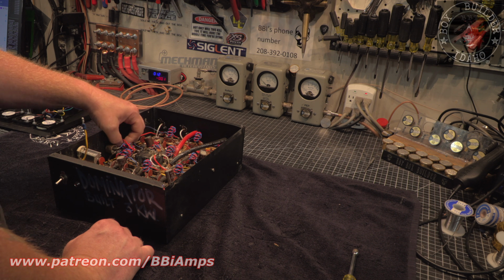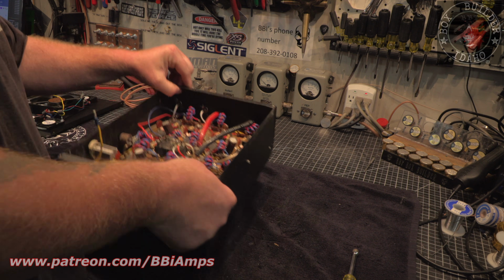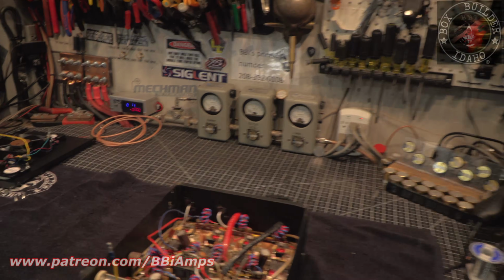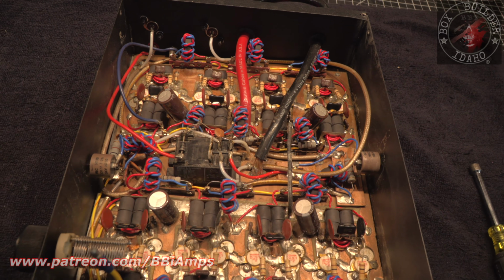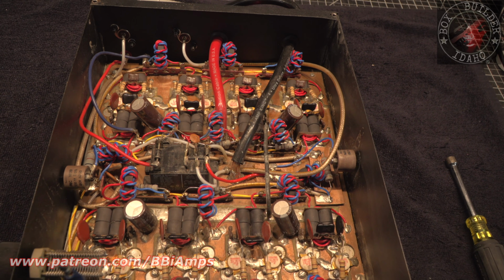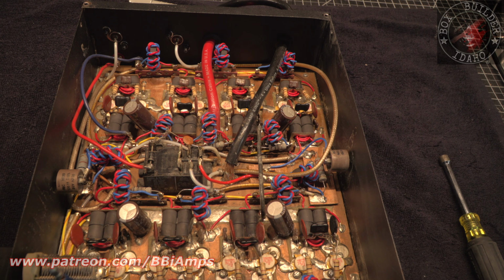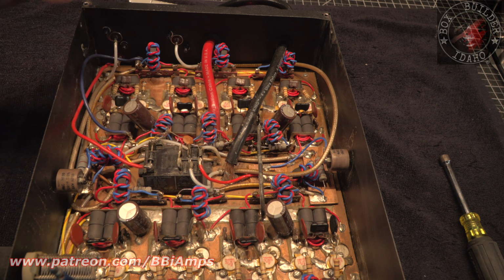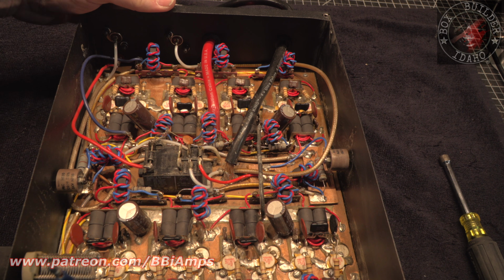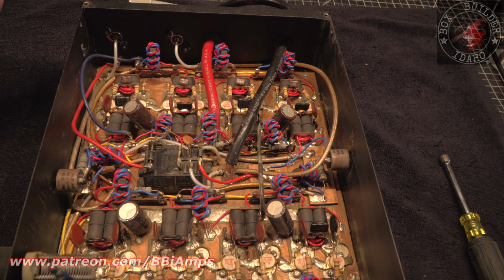Yeah, so this is the key circuit. Doesn't look too bad. So here, let me explain to you why the coax lengths have to be different. This is an age-old question. You cannot take the Carl built, X-Force, Dave made style amp coax lengths and run them with one of these style of boxes, one of these builds. It's because there's coax on the inside of the box. So the coax runs from here to here, right? Well, this is our output side. All right, here's our input. We got coax from here, runs around and goes over to here.